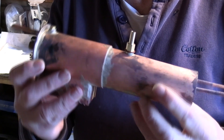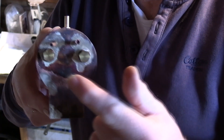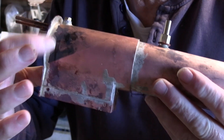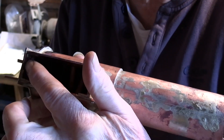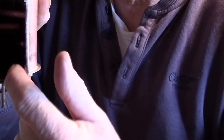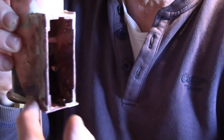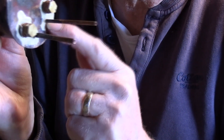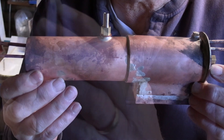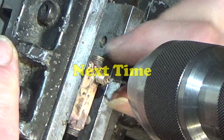Here's the boiler now — I've done a little bit more on it since. I've silver soldered the back head onto it now, flush against here with some angle brackets holding it in position, so that's all silver soldered in. That's quite a fiddly one because you've got to make sure it's all level and there are no extreme gaps — the silver solder's got to flow all the way around inside there and on the outside as well. I've also silver soldered these two tubes in. I hope you've liked this video — please hit the like button and the subscribe button, it's very much appreciated. We'll see you next time.